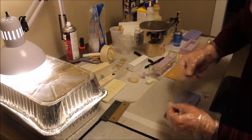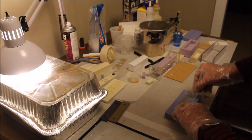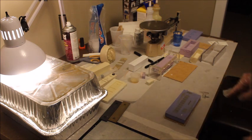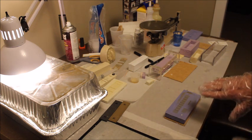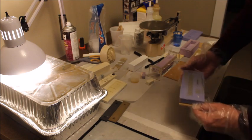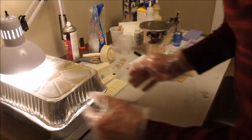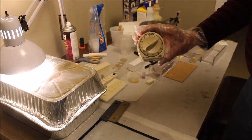And now we're going to put the flat back on here. I take it and press on there and gently squidge it down. Now, as you can see at this, you can clearly see the rubber color through there. That means that I've got a very thin flash on there. So now we're going to pick this up using the carrier. Drop it in the oven, and then I will wait, let it bake for 10 minutes.